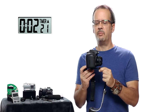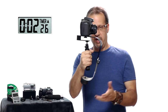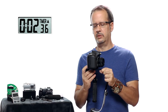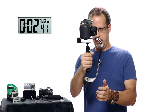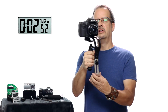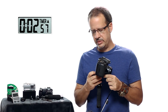Okay. I just moved it about a 1/16 of an inch. Very small amount. And as you can see, that was too much. So I have to move it backwards now. Half that distance. Boy, we're talking just about a hair's width. Okay. And now we're starting to tilt off to the right again. Okay. Remember, this is going to happen over and over again, in smaller and smaller steps. Good left to right. It's still tilting just a little bit down.